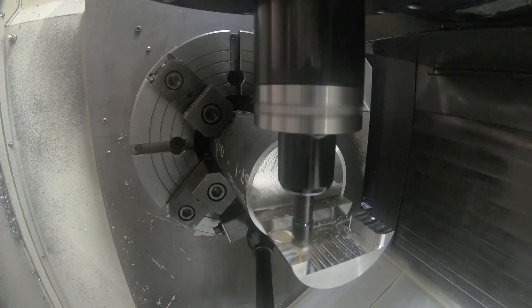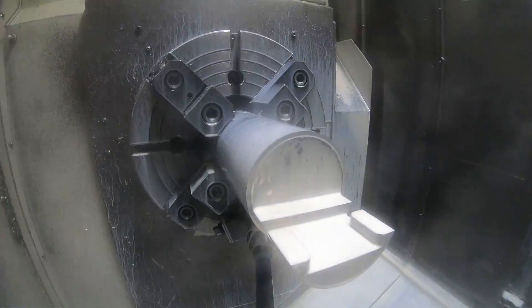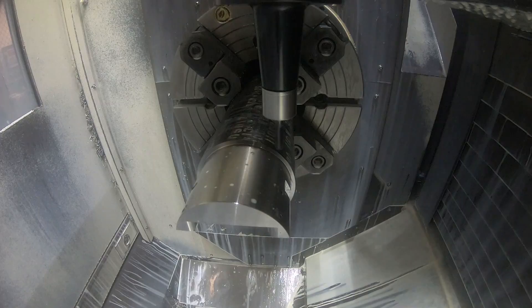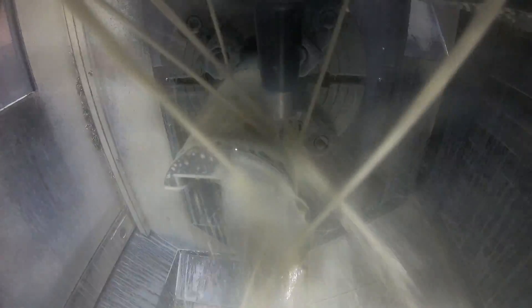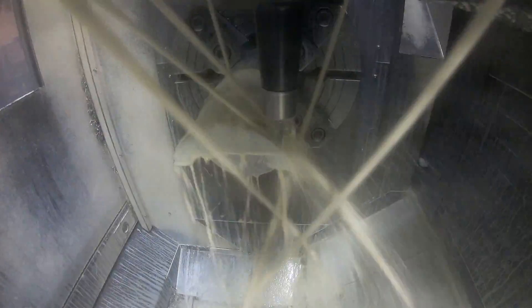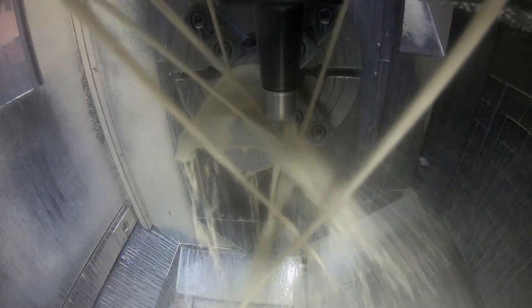I'm going to get a spot drill for the screw holes - a single-flute spot drill, high-speed cobalt. Then a 265-thousandths drill for clearance for a quarter-inch screw. Coming in with a quarter-inch four-flute carbide end mill to mill the counterbores for the screw heads, doing a helical spiral down to get the counterbore in there. I don't really remember the feed and speed, but the end mill is probably going at least 6,000 RPM at around 30 inches a minute. This is also sped up quite a bit.